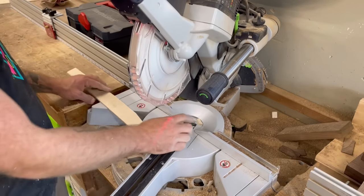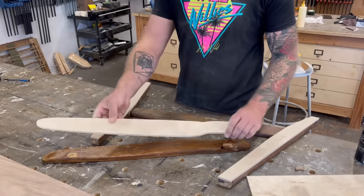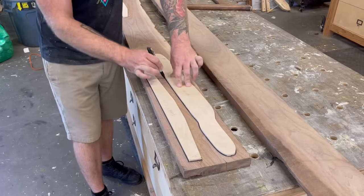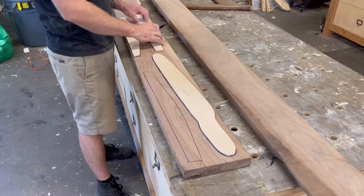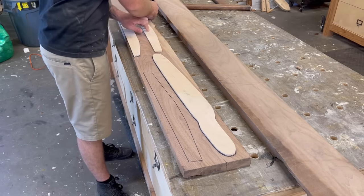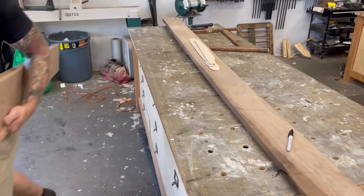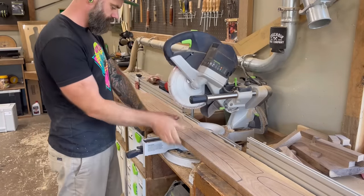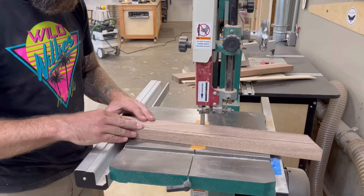Then I laid each one of my quarter-inch plywood templates onto the old pieces to make sure nothing looked too crazy — so far, so good. Then using those templates, I traced out each one of the shapes I needed onto some new black walnut stock. Remember we're making two sides of this chair base that are identical, so we need two of each individual piece. I managed to fit all those pieces onto one board. I took that board over to the miter saw, cut it up to make it easier to cut out each individual shape, then went back over to the band saw and cut out each shape roughly.